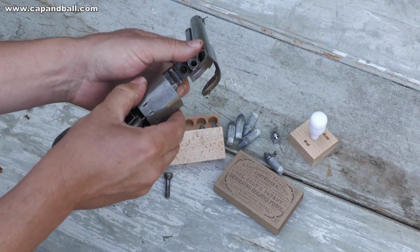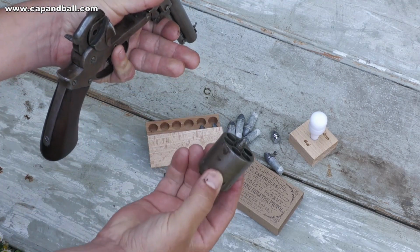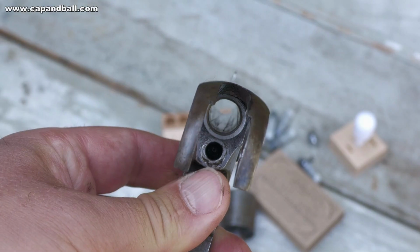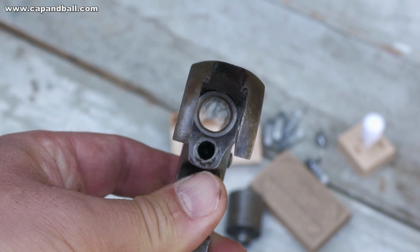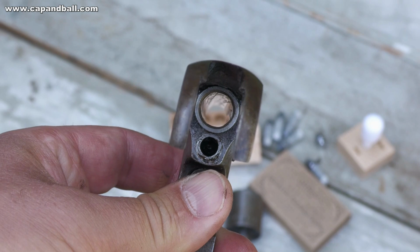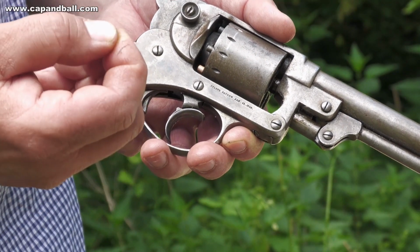The caliber of the Starr revolver is actually larger than the normal 44 caliber. The chamber mouth is 0.464 inches in diameter, but it's shrinking towards the breech. The land-to-land diameter of the bore is 0.454 inches, but it is 0.479-0.480 in the grooves. The rifling has 6 grooves, with one turn in 40 inches twist rate.